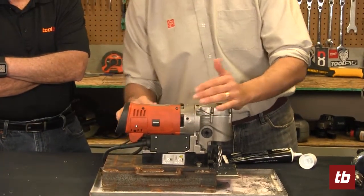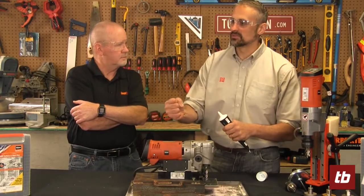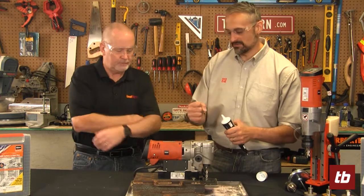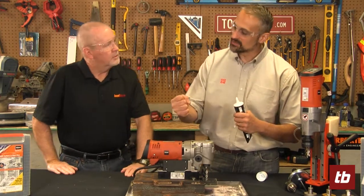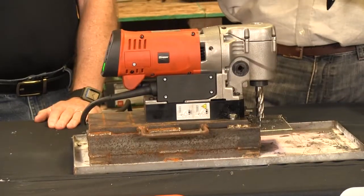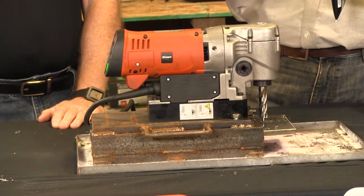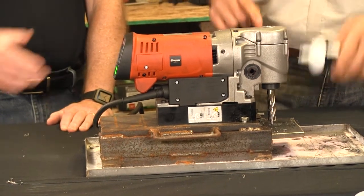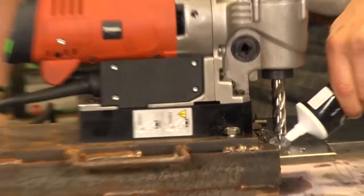It's very unique. You'll hear when I start drilling — the machine tells you where the right speeds are at. Pushing harder doesn't mean it's going to cut faster. By using cutting paste and giving constant pressure on the machine, first off the machine's going to last longer, second your cutters are going to last longer, third you're going to get a lot more holes done in a certain time frame. Let the tool do the work — that's why we have them.